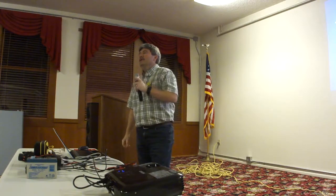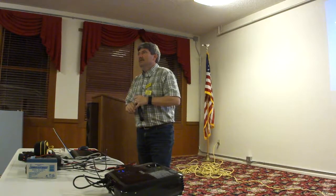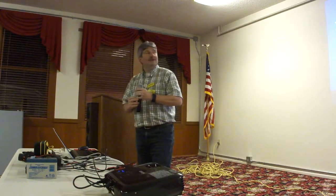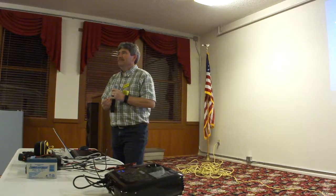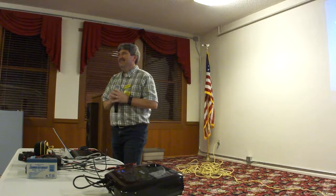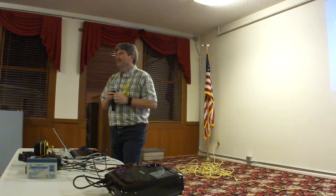Yes, sir. A few years ago, there was a kit that came out for the 80-meter band, based upon the color crystal. If you notice, that frequency is right in the color burst you see for TV. There's one little simple board, and you wound your own toroids, it's about 7 watts transmit, and you just plug that directly into the audio ports of the computer, and you had an 80-meter radio. Very cool. You couldn't work the world with it because it wasn't very sensitive, but you could get on and do 80 meters. I got one at home someplace, so I'll pull it out and look at it.